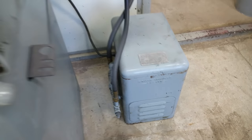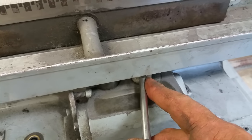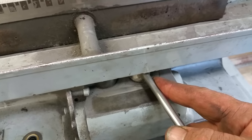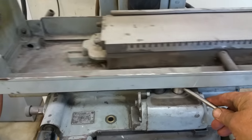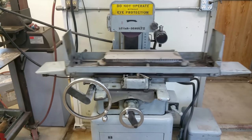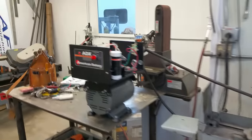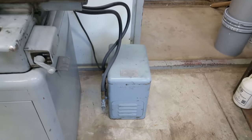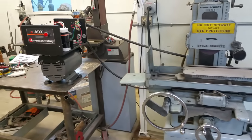We're spinning in the right direction, and both motors phased correctly. That hydraulic motor down there — let's turn on the hydraulics and get some juice flowing. I heard it kick, hydraulics are running. Cracking it to let it bleed off and burp the air out. There it goes. Now I just need to find a home for the phase converter — probably mount it down low by the hydraulic unit, not on the dirty side of the grinder.